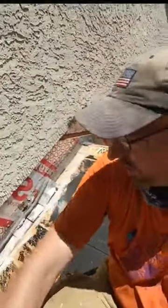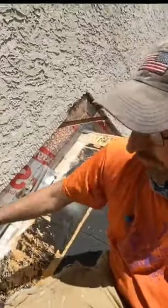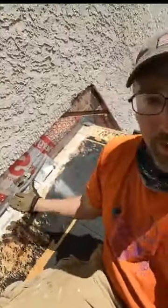I don't think the water was getting down through the stucco — that was the first thought, that we need to do something with the stucco. It's more just how it was flashed and counterflashed, and the moisture getting in this way when the wind drove it, we think.